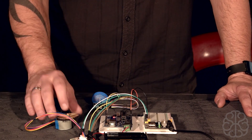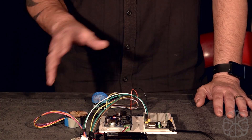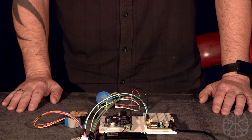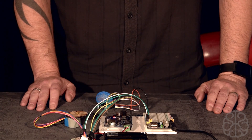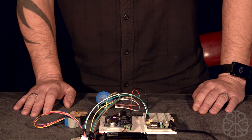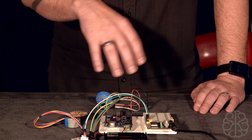This is a great way to start with stepper motors — the 28BYJ-48 is cheap and accessible, even if it's not fast or high-torque. This is going to be a multi-part tutorial: we'll keep using the rotary encoder but upgrade to a NEMA 17 motor driven by an EasyDriver motor driver board. We'll also add buttons and a buzzer — the buttons will set in-points and out-points so the motor can travel between set positions. Visit brainybits.com for the tutorial page, schematics, downloadable code, and parts in our store.